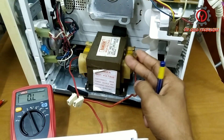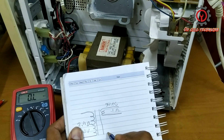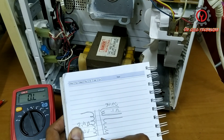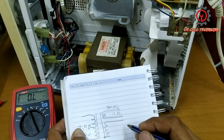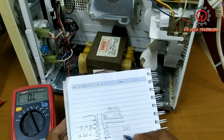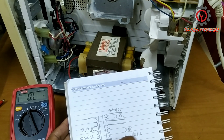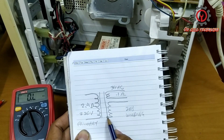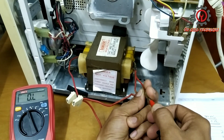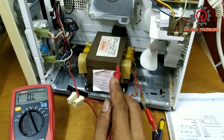The question is: why does the secondary winding only show one visible terminal? Here is the secret — the other end is connected to the core. This one is connected in the core, and this is our secondary winding and this is our primary. The other end is connected here to the chassis, and I'll tell you now that it is grounded because it's connected to the chassis.